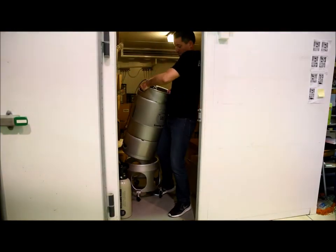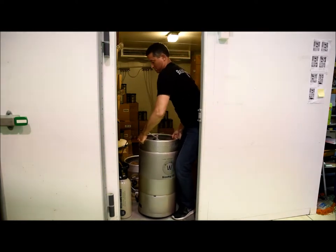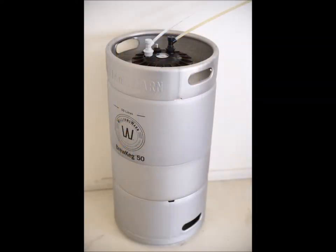A commercial business with draught beer taps can now take the brew keg off its stand and connect it to the draught beer system. During the clarification stage for a commercial premises, the brew keg will likely have been attached to the CO2 system rather than to an individual gas bottle. So all you need to do now is connect the beer side to the draught beer taps. The draught beer line will need to be connected to the out port on the lid of the brew keg with a black quick disconnect fitting.